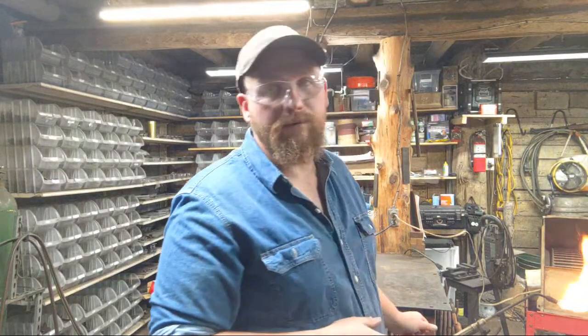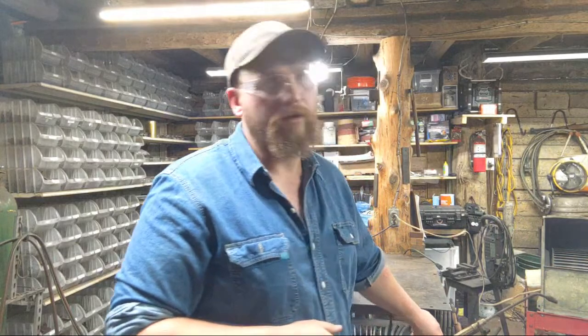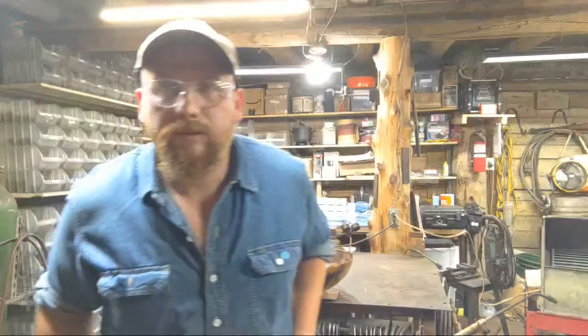So, pro tip, always turn off your oxygen if you're using torches before you turn off your gas. That way it doesn't backfire.